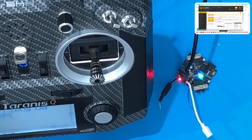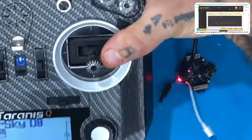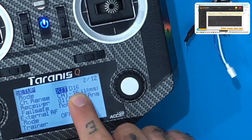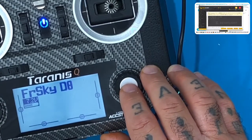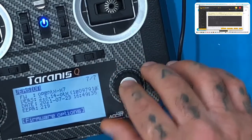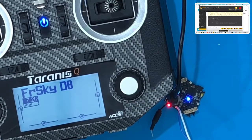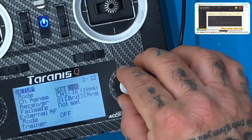When you want to bind this thing, go to your CLI. This says FrSky D8 but I actually changed to D16. So first thing — make sure you're set to XJT D16. You have got to be running version 1.1.3 — you cannot be running version 2.1.0 on your FrSky firmware for your internal module. I downgraded it to 1.1.3, so make sure you download that.